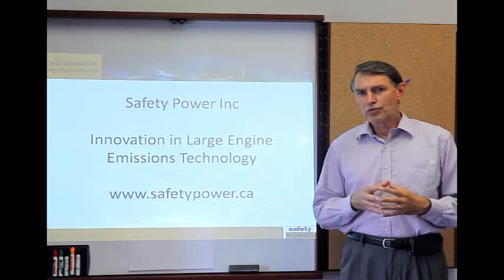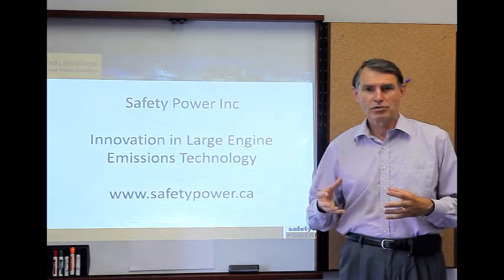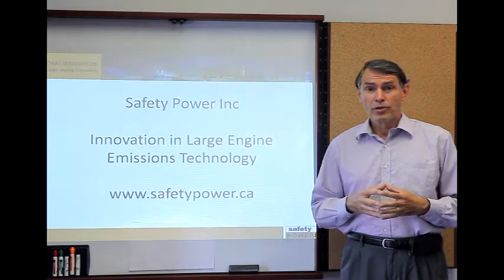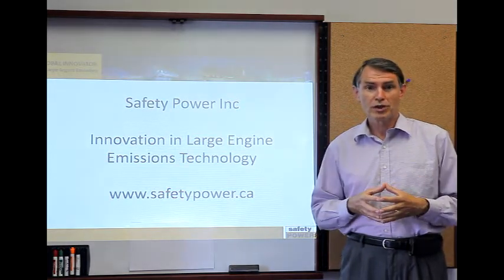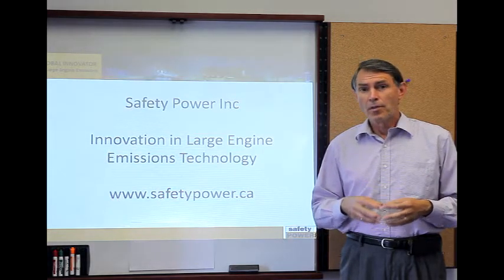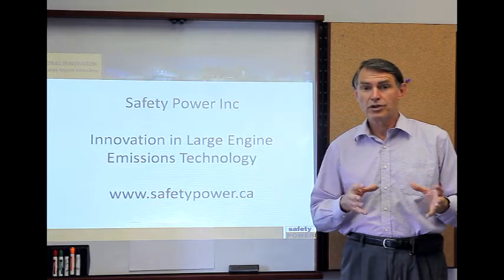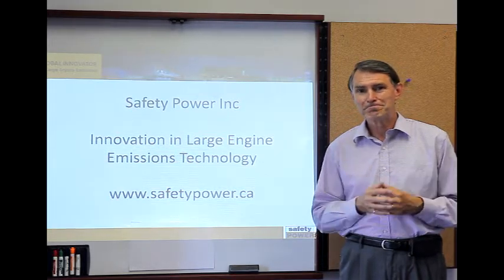While the ecoCUBE control panel contains high pressure alarms and extra high pressure alarms, there may be times when the operator is unable to respond to those alarms. In addition, there may be situations such as an engine backfire where a high pressure wave is created that could impact the internal workings of the ecoCUBE. The MagRelief valve is a patented safety device that's designed to protect the internals of the ecoCUBE and also of the engine that the ecoCUBE is connected to.